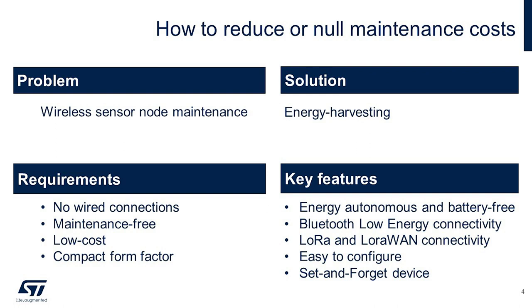And as engineers, we are working on that. So according to that, our ideal sensor for agriculture does not have to need maintenance. And the maintenance in the state-of-the-art sensor is basically the battery. The battery, we know, has a limited number of years after which we lose capacity, and we need to go and replace the battery, if not the sensor. So the ideal sensor should be, of course, wireless, maintenance free. It's very important.